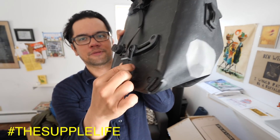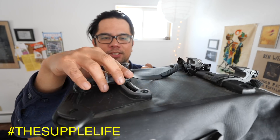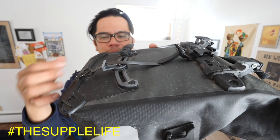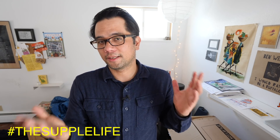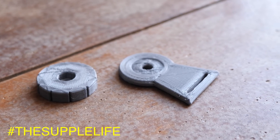Here is the part. As you can see now, there's a place to prevent the bungee from just moving left or right — it passes through pretty easily. The only other modification I would change would be the nut, to get a domed nut so there's less friction with the elastic band. I've tried it on a couple of bikes and it works awesome. Another modification I would probably try is to bring this slot up closer — seeing how it works in person, there's actually no need for this to be so long. It could be shorter and still be effective, so this is just extra material I can take off. The material the 3D printer at the library uses is PLA — a plastic material. It's good for prototyping, but it's not the most durable, so this probably wouldn't last too long in the field, but it's a cool proof of concept.